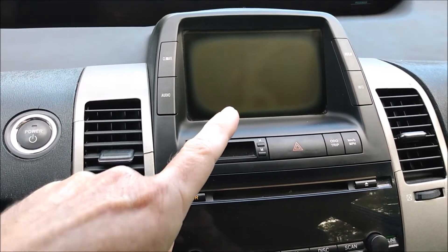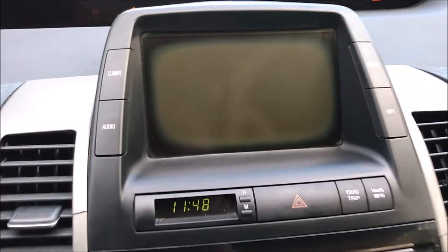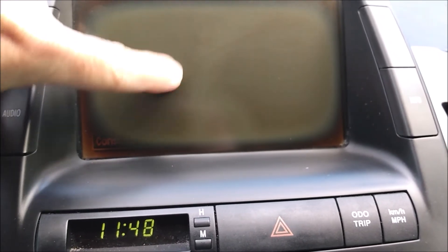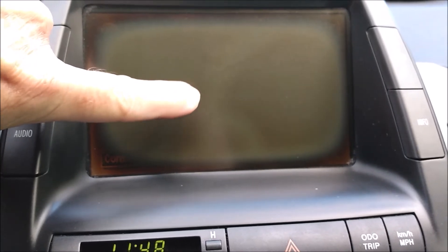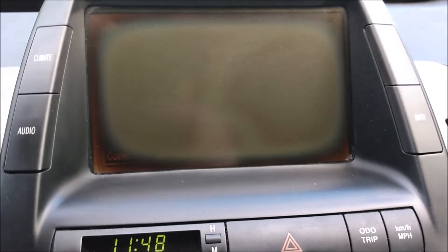That's a lot of sun damage. Even with the power on, you can't read the screen — just a tiny little bit around the outside edge. So what I'm going to do is try to rub some of this yellowing off and see if the LCD screen below is still good. That'll tell me whether I just need to replace the digitizer, or the digitizer and the LCD screen.